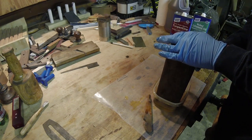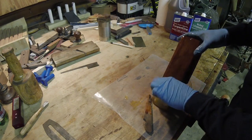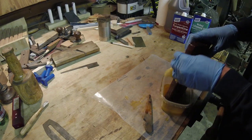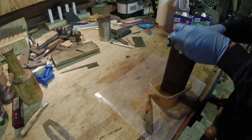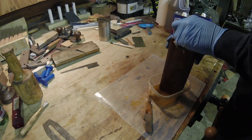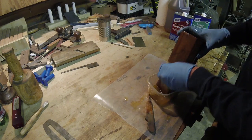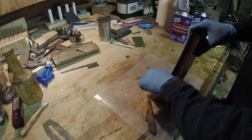The vinegar and the turpentine obviously are going to dilute the linseed oil. The idea is that it's thinning it out so the wood is drinking it back up, rehydrating it - that's the point of this recipe. This is actually going to take several applications. You're probably not going to see all of them - you'll see the first one and then you'll see the end, and I'll tell you how many were in between.